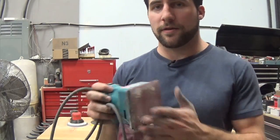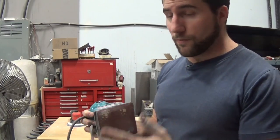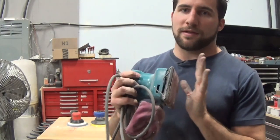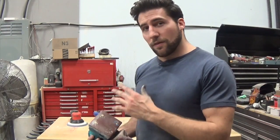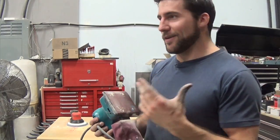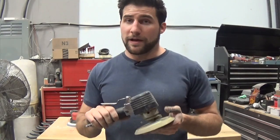Speaking of sanders that just vibrate — this one doesn't spin or anything; all that happens is the sandpaper on the bottom vibrates against the wood. It's faster than hand sanding but smoother than an orbital sander because you're not getting that torquing motion dragging the sandpaper across the wood. This is a nice sander for finish sanding wood — not paint, not for polishing. It's really good for finish sanding wood itself, so I think everybody who does general finishing should probably have one in their shop.